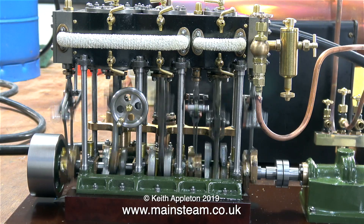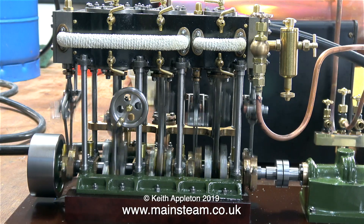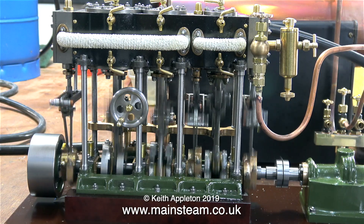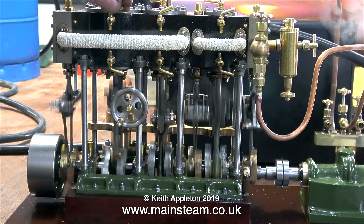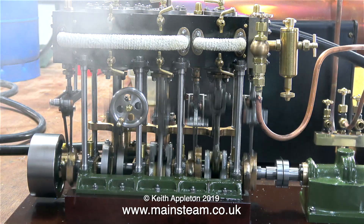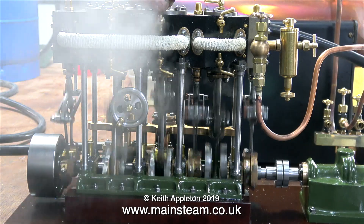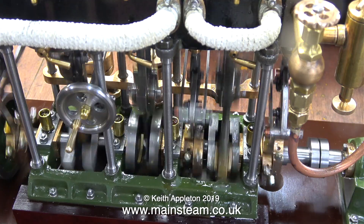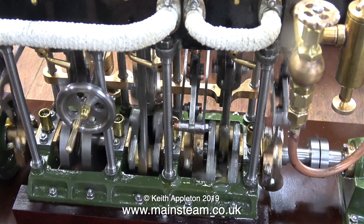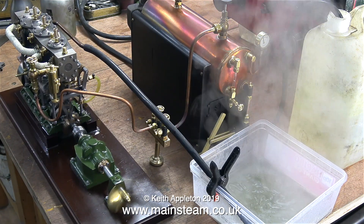In the following clips you'll see it running forward and reverse, and I show that yes, it notches up as well. Nothing much seemed to happen when I ran it on compressed air and opened the drain cocks on the low pressure cylinder. Now trying it under steam — when I open the drain cock on the low pressure cylinder it spews forth much steam and water, as does the medium pressure cylinder. The high pressure cylinder covers both me and the camera lens with oily water. It's definitely time to stop talking — thanks for watching, stay well.